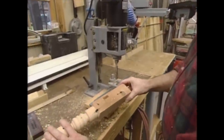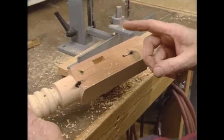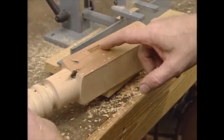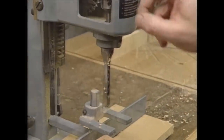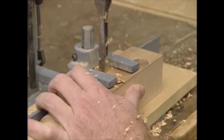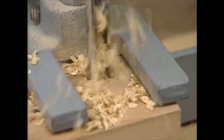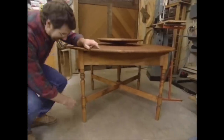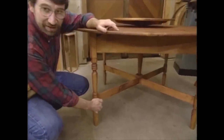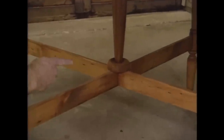The legs will be connected to one another with rails, and the connection between the rail and the leg is a mortise and tenon joint. I like to cut the mortises in the legs first, so I'm using my dedicated mortising machine, set up with a three-eighths inch mortise chisel. There's a drill bit in the center that removes the bulk of the material, then the chisel squares it up, and I just mortise from layout line to layout line. There's one more mortise I need in each leg — to receive the stretchers, which go diagonally across the table. They're very important because they add strength to these thin pine legs and also create a resting point for the carousel axle.